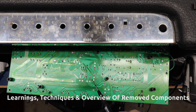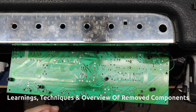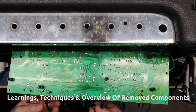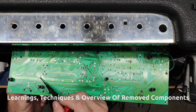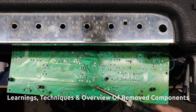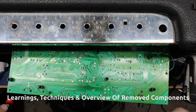I want to talk about my technique because it will be helpful. This is a single-sided board; the holes are not through-plated, so you have to be really careful with dwell time. A lot of these leads are bent over hard where they're soldered, which causes friction during removal. That's why on the main filter caps I cut one side to free them mechanically. Then when I heat up the hole, I can rotate the cap so it comes out nice and smooth. I use a very fine solder tip so that when I heat a pad, I'm not on it long and I'm not using a lot of surface area.